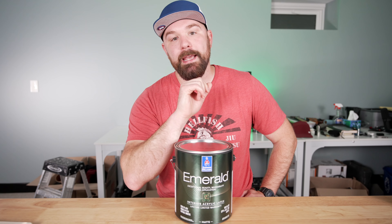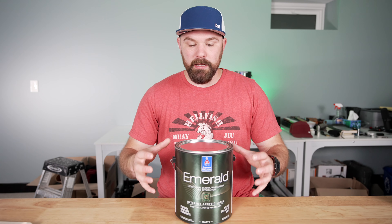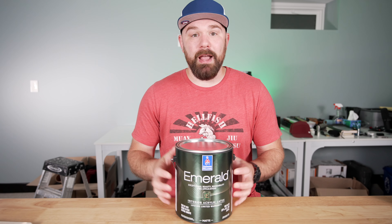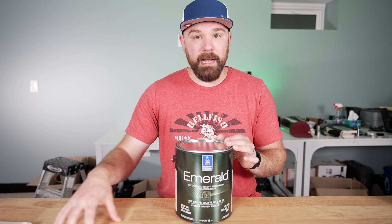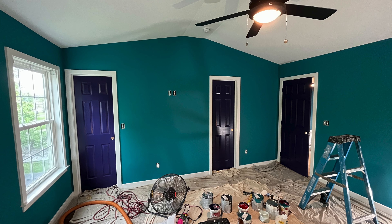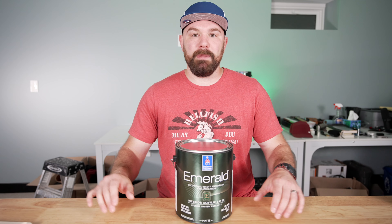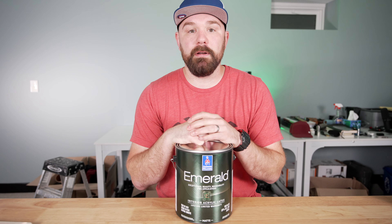So, is this product right for you? The answer is: it depends. If you're a professional doing higher-end work in nice homes, I would definitely recommend giving this a look. If you're a homeowner who's relatively confident laying down product and you notice the difference between nice paints, give this one a go. From my experience, more expensive doesn't necessarily mean easier to work with, but this one actually is. If you're doing an accent wall or a really dark room and you're using Sherwin-Williams paints, I would bump up to the Emerald for any of that. Let me know what you think in the comments. Until next time, take it easy, work smart, and have a good one.